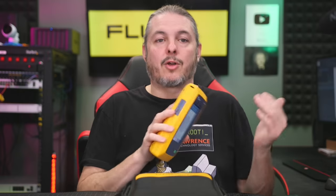We found that to be helpful. If you have a camera that's out, you're not sure if it's the camera, the switch, or if the PoE is turned off. Sometimes it was as simple as the PoE being turned off; other times the PoE port just went bad or the camera's bad. But before you just plug another camera in and hope it comes on, you could plug this in, know where it goes, label where it goes, put a label on that wire, and also have a PoE load test to see all the different loads come through.